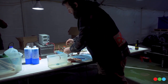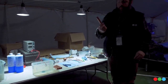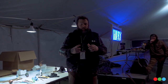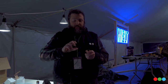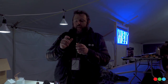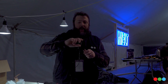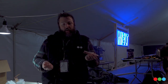And you know, pretty simple to bend it, pretty simple to cut it. With this copper tube or pipe, it's actually really easy to cut too. There's just a simple little tool you can buy. I think it costs like $6 or $7. And it's a little tool that has two little cutter wheels. It almost looks like a scoring tool. And it has this one little knob on it, and you just get it to fit on there just where you want it. And you just cinch that knob down just a little bit, and then you rotate it around, and it puts a thin cut in it. And then you just turn that knob one more time and one time around and one more. It just takes zero muscle. And then the pipe just goes pop, and you've got your pipe.